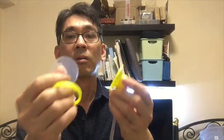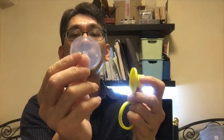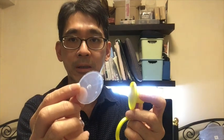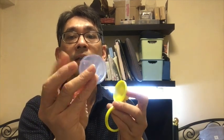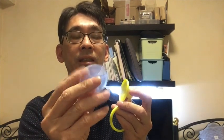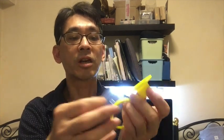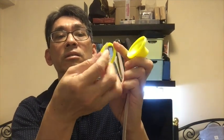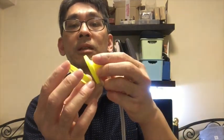The acoustic earbud can also be used as a stethoscope. After printing out the parts — the stethoscope chest piece and the ring — you also need to cut out from the bottom of a plastic disposable drinking cup a piece of hard plastic to be used as the diaphragm. There is a part called the diaphragm holder where you can use the hole to mark and cut it to the exact size — it should be loosely fitted into the ring. If it's too tight, it will muffle the sound and it will not pick up a heartbeat.